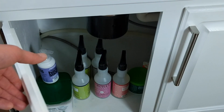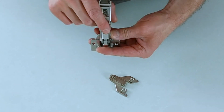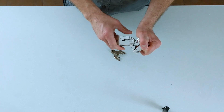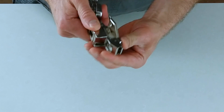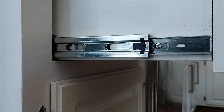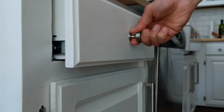I was going to use the really nice hinges that softly close your cabinet doors, but unfortunately it was just way too much work to modify the cabinet doors and the cabinets to make this work. So I did actually end up buying some of those hinges just to see if they would work. If you have those nice hinges in your kitchen where you can just snap on and off your cabinet doors and everything is adjustable — check them — 90% they're made in Austria by Blum. I might be a little biased as an Austrian but I'm telling you they make the best hinges, and I'll prove that in my next episode where I show you how to build a kitchen island and a refrigerator cabinet. I did however replace all my drawer slides because they had flimsy plastic rollers and I just wanted something durable. You can almost sit in the drawer now — it holds up to 120 pounds.